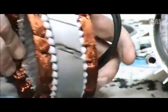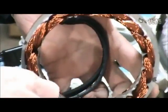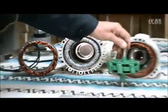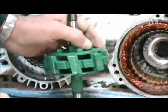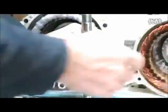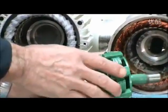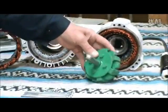Now, this is our new permanent magnet generator stator core — this is just the small one. We've skewed the stator core. We are at the same angle as the SkyMax Wind is, and this is the best. Now, what some guys try to do — and this is a real popular company that does this — he slants the magnets. He can't afford to skew the stator core like these state-of-the-art stator cores. So what he does is slant the magnets. The problem with slanting the magnets — he's trying to get away from the cog — but this rotor has to be so small and so far away from the stator core not to cog really badly that there's literally no output out of these things.